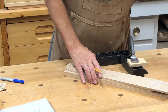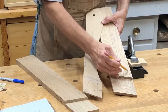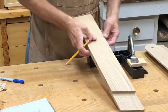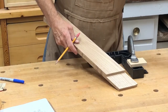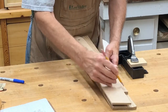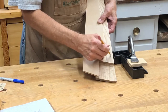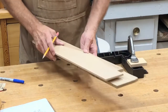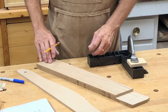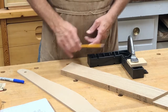I did that on all four seat pieces and the four back pieces. Before I cut it out on the bandsaw, there's a section that has to be cut to three inches — just this part right here — on the table saw so I know it's straight and smooth. I'll cut that on all eight pieces. On the seat, I can cut straight and this is all waste. But on the backs, I've got material up here and only this part is waste, so I'll have to be careful and stop before I cut into the curve. I'm going to do that on the table saw, then cut close to the line on the bandsaw, and then we'll be ready to put the templates on for the routing.